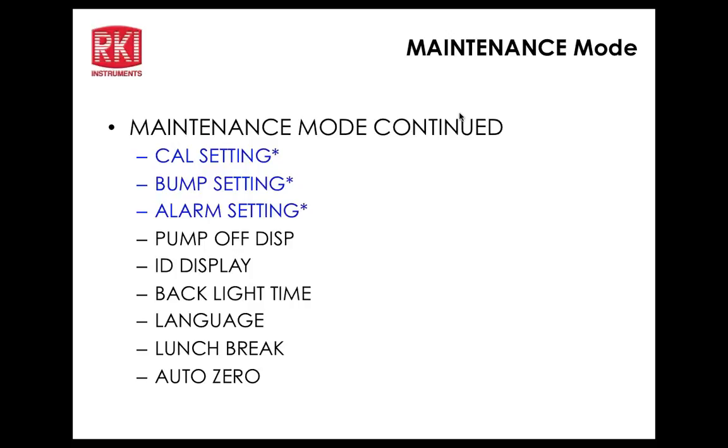Leak check bar hole mode, this is where you activate that, and since there is no percent by volume sensor in there, we actually cannot activate the bar hole mode, but the leak check mode is active, as you can see. So other options would be bar hole mode, leak check, both of them basically. And then off, or leak check mode, back to leak check mode. So I want to keep that. Normal mode is not an option in that screen because normal mode is always going to be available, always.